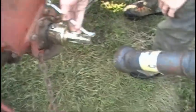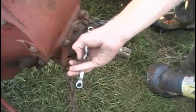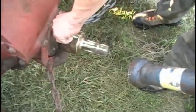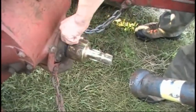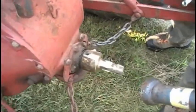So it turns out we do have to take off the overrun. This shaft is designed to go directly into the PTO without an overrun in the way. So we've got to remove the Zerk fittings on both sides and knock the pin out. I'm working on that now.